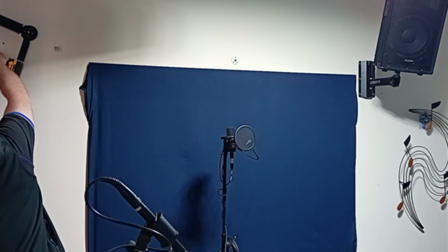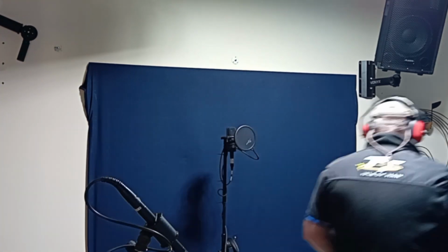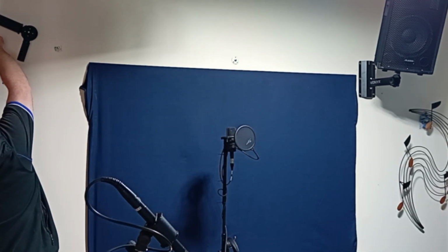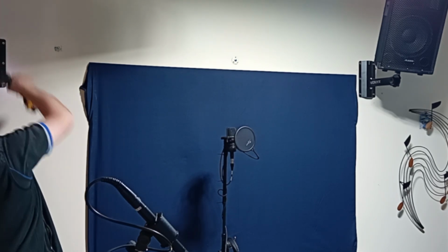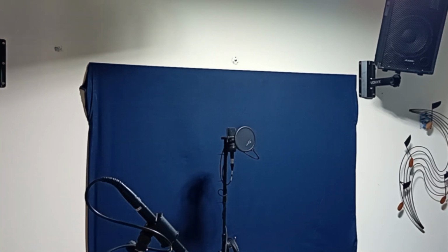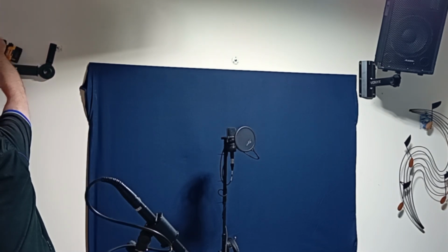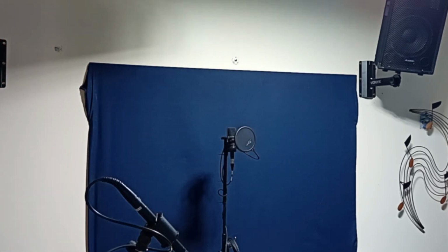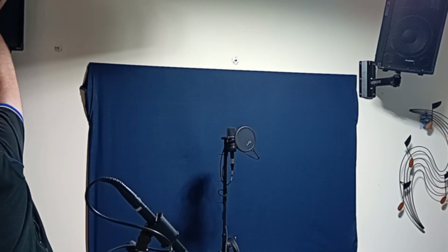They're also nice and high and away from the wall, which means we can sing standing next to them without having terrible amounts of feedback, just an acceptable amount of feedback. Again, same trick, brilliant camera angle there. You mark out the 6 holes with a pencil, drill, hoover, rawl plugs, screws, done. Then a final adjust to make sure that the bracket is level. Throw the second speaker on, and there you have it.